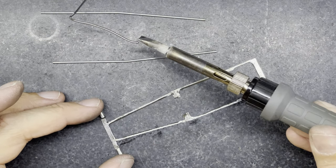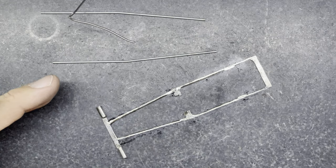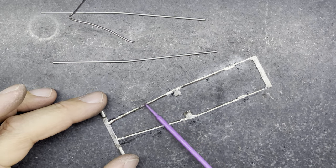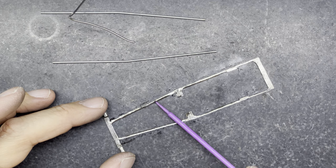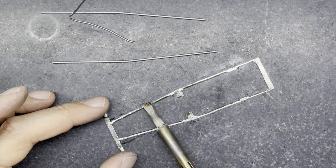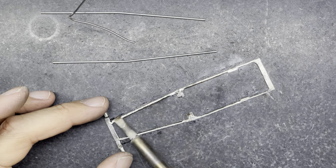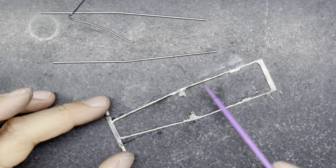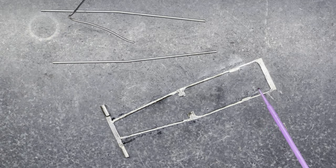It's not too bad on the other side. You can see the solder's not taking here, but while it's warm we'll get some good acid flux on it and we should get a little bit more tinning. There we go - you can see it started to tin now.